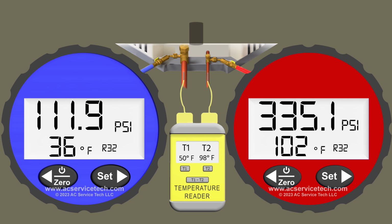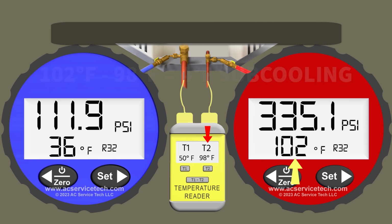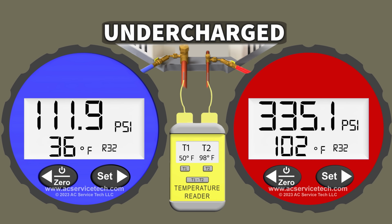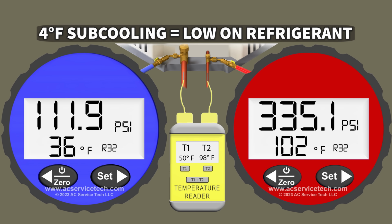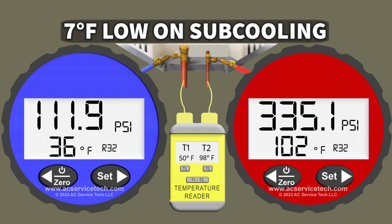Okay, so you notice that we have a 102 degree saturated temperature in the middle of the outdoor coil minus 98 degrees as the liquid exiting the coil. So that means that you only have 4 degrees of subcooling. If we have a target of 11 degrees, then that means we are undercharged because we only have 4 degrees of subcooling. We are actually 7 degrees low on subcooling.